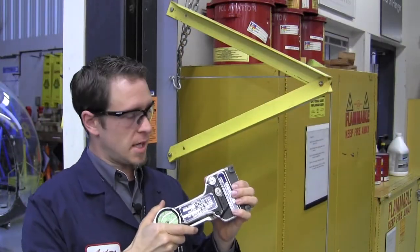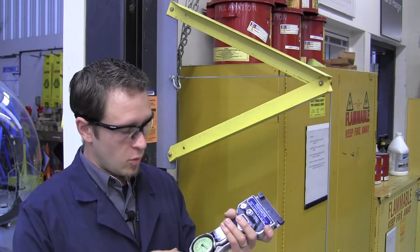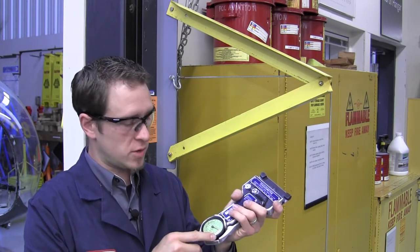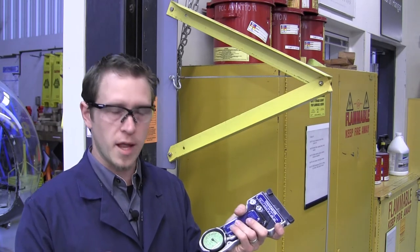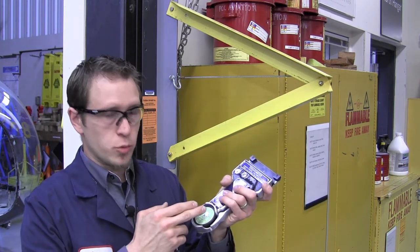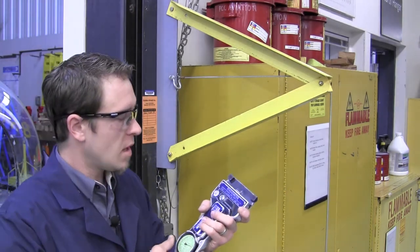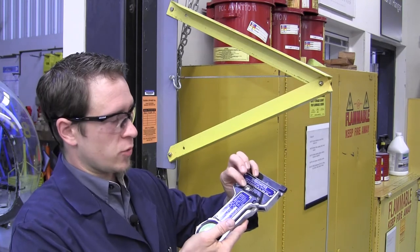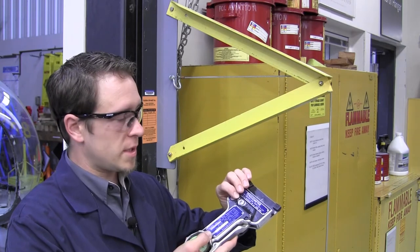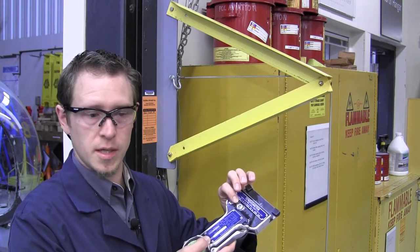That's the C8 tensiometer, and as you saw in the video there are a couple of things to really watch out for. First, you have to make sure that you turn the dial correctly, because if you set that up wrong your readings are all going to be off — and you will have to take it again, because the only way to set it is when the needle is at zero. Also, make sure you read the scale correctly and that you're reading the correct scale. If you try to take a reading with the scale locked it's going to mess it up, so always take the readings with the scale in the off position, and then if you want to lock it you can slide it over to the on position.